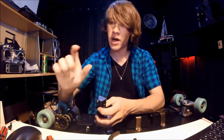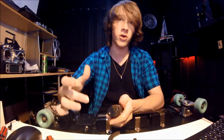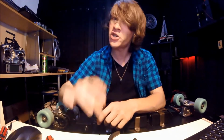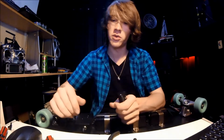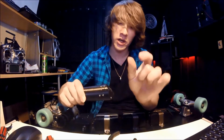There you go. So you can buy these cheap little power banks, and if you buy a good quality one, they'll have a voltage higher than 5 volt, and they'll step it down. If you buy a cheap one, they usually just have a 3.7 volt LiPo, just a 1-cell, or a very large one though, and that'll be going through a little micro step-up transformer to 5 volt. I 3D printed a little roller wheel, and that is glued directly to a potentiometer that is glued to the side of the top part of the case here.